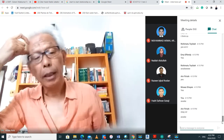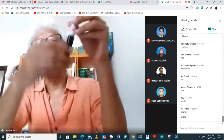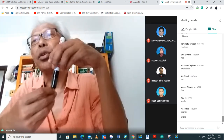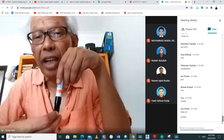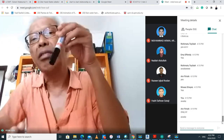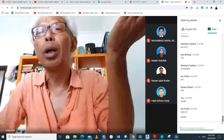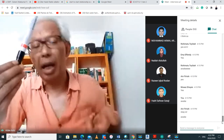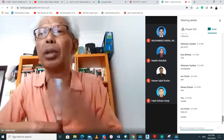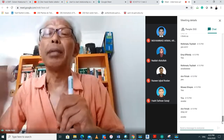So I'm giving you all these formulas and all these theories, and all I'm saying to you is that you have a pile. If it is in sand, you have the adhesion and the friction. If it is in clay only, you are only going to have the adhesion value, in other words, the cohesion. Cohesion at the tip, and then you have adhesion around the shaft. If it is in sand, you have the tip value, which is the end resistance, and then you have full friction if it is zero cohesion, okay? And then those things I just mentioned, K tangent delta and whatnot, and the tables on how to get these values to put into the Q ult equation, equals A_S multiplied by f_S, plus A_T multiplied by q_U.